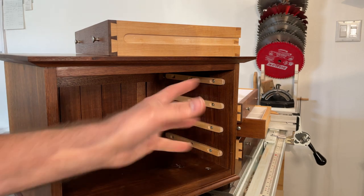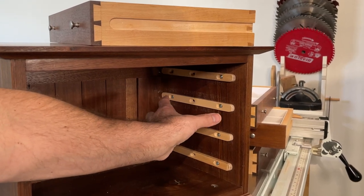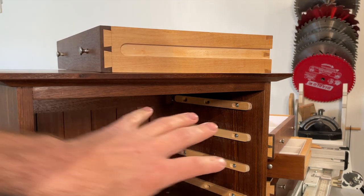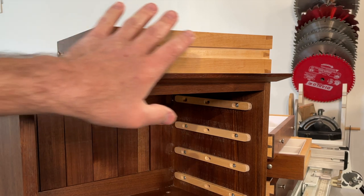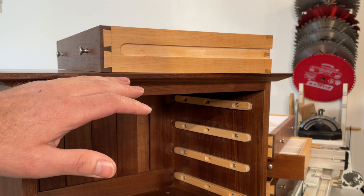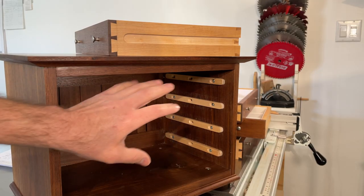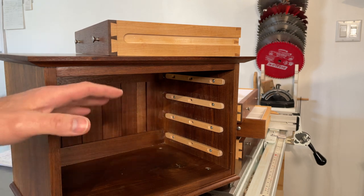I really struggled with how to get the drawers to open and close, and ended up settling on maple drawer slides or glides. Because the side panels expand and contract front to back, I put them into slotted holes for the screws so they can move as the carcass expands. If I was going to do this again, I don't think I'd do it this way — I'd rather leave the drawer sides untouched to show off the joinery. I'd probably make shallow web frames of about a quarter inch high between each drawer instead. If you have other ideas on how to incorporate drawers into a small piece like this, let me know in the comments.